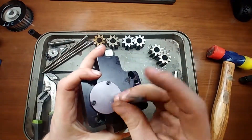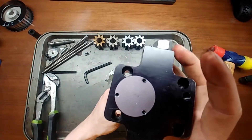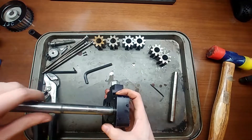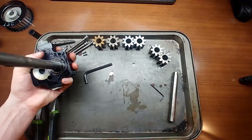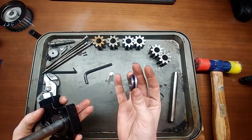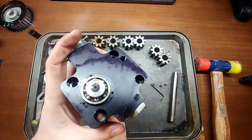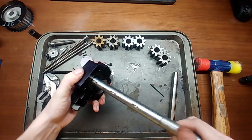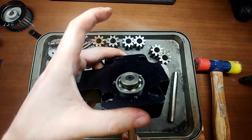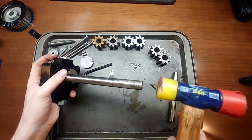Your final driven gear and your last woodruff key. If you truly want to take it down to completely nothing, this is where things get interesting. This is your driven shaft — it has to spin no matter what, so there's actually a captive bearing back in here. You can't pull it through this way; you have to take this little back cap off. With that off, a few taps of a hammer and the back cap pops out. There's an o-ring seal in this pump. On this side you can see the bearing that the shaft actually rides on.